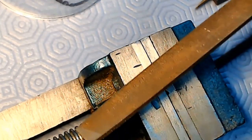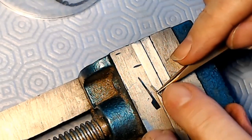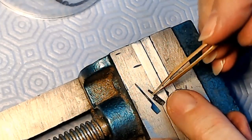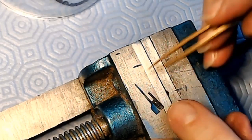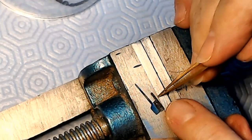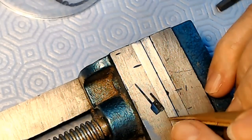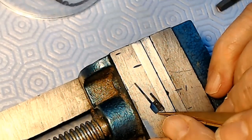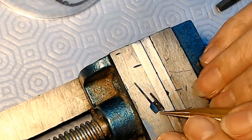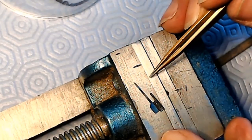Starting again - I found a nicer file here and it's starting to look more like the part. If I look at the width there, that's pretty darn good. That is what the part looks like now, and that is the part I'm making. It's a bit like that. If I put that in place I can figure out where to drill the hole here. I may want to move the part over a bit. I'm thinking I may just bend a piece of metal in there to make a tab so it tucks in, which means I've got to file both sides down and then make the tab.